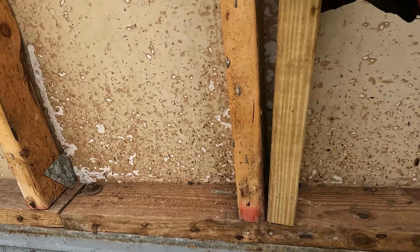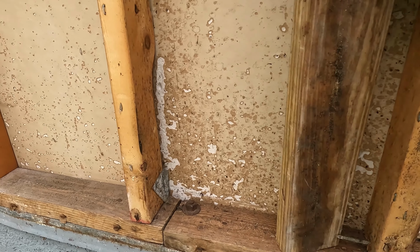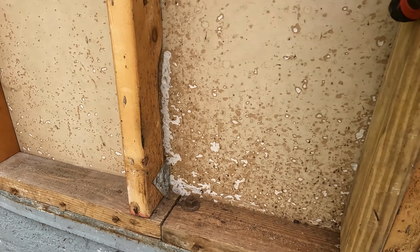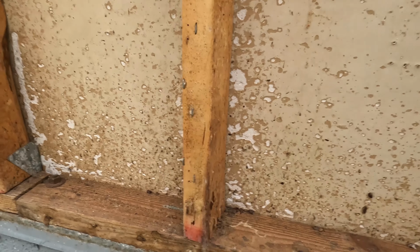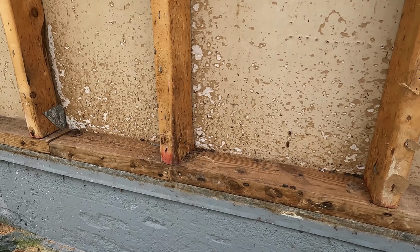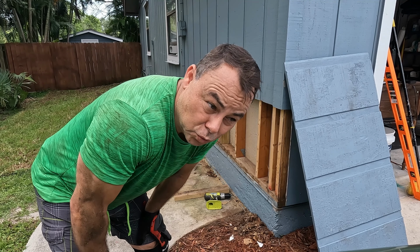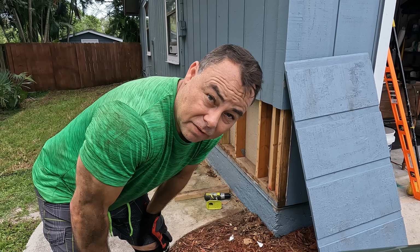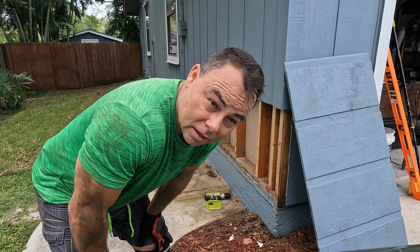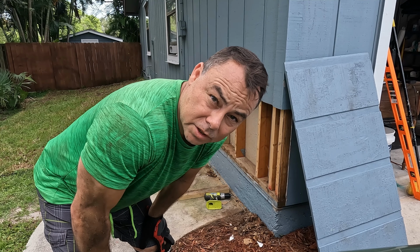So I cut me a couple pieces of 2x4, and I'm gonna put one on either side, and the structural integrity is brought right back in. It's called sister studs. Then instead of nailing, I'm gonna drill in with some good wood screws about 2.5 inches long and 3 inches long, and I'm just gonna splice these two sister boards into that stud.